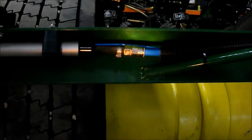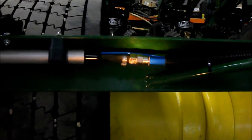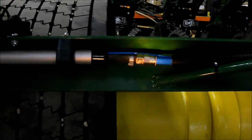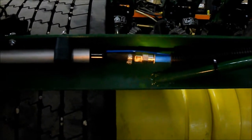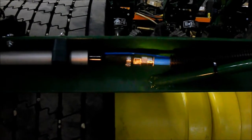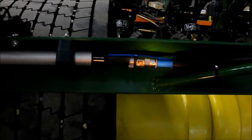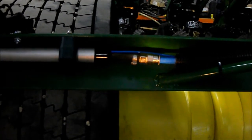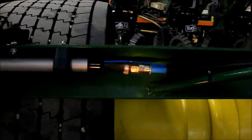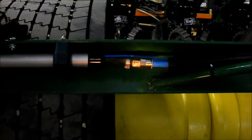Go ahead and pick out a barbed end fitting by push connect, and once you're done doing all your connections down at the wheel end and the rotary union, pull your extra hose back up this direction and connect the barbed end of the rubber hose with a crimp clamp or a screw clamp. Your 4mm airline needs pulled snug at that point, and the extra used up and cut off down at the rotary union.